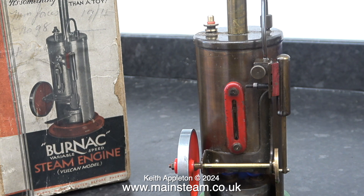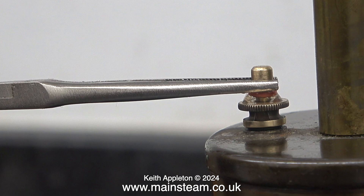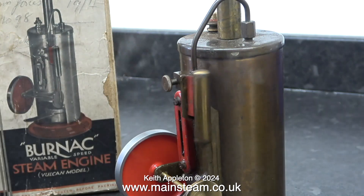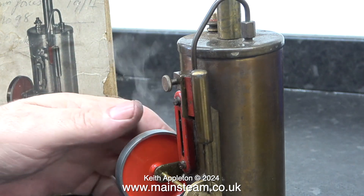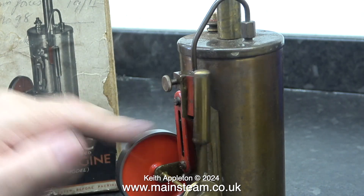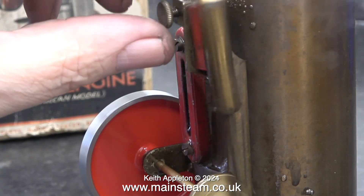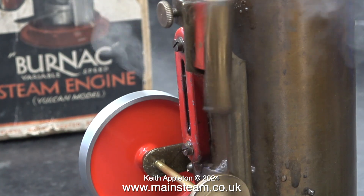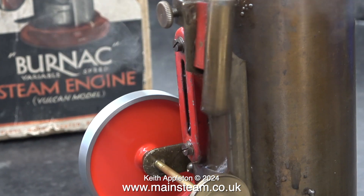I did leave a bit of a steam space, but not enough. When I lift the safety valve with a pair of pliers, as you can see there's not much in the way of steam — just a bit of water. Eventually, with the help of the excellent spirit burner, some steam starts to appear around the engine, but it's all in the wrong place. Most of the steam is coming out of the front of the water gauge, which is never a good sign. After much manual rotation of the flywheel, suddenly the engine bursts into life. And in this clip you can see just how much steam is coming out of the front of the water gauge.